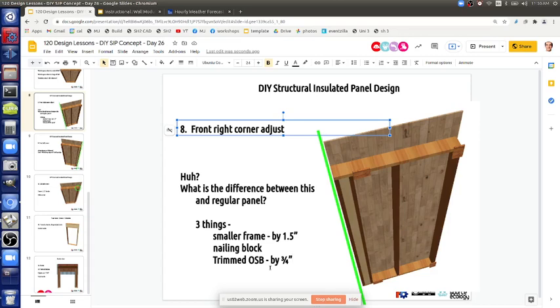Right, okay, so we didn't talk about that, but you'll see it on a frame. Now we've got this gap. It's probably going to be anywhere between nothing to... which we have to cut a strip to bond that together. Finishing stuff, yeah, that's trim. That's finishing, but it's the gap fill. Gap fill would be structural lumber that we screw in there.